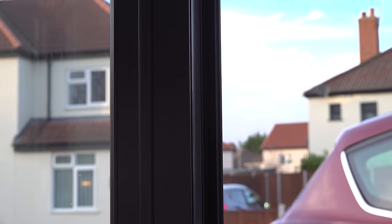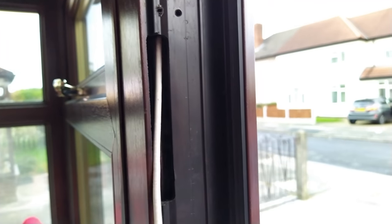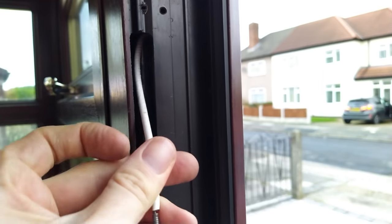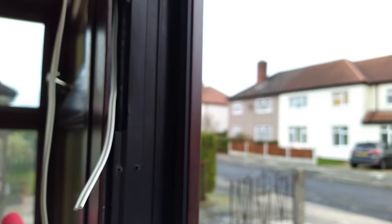Things started to get really complicated as I have a porch with a UPVC door frame and I wanted to mount the doorbell with the cables completely invisible from the outside. I started by removing the upper doorkeep to get a look inside the frame, which is obviously plastic on the outside but metal on the inside. Poking a flexible curtain rail up I could get a feel for the inside of the frame and it confirmed that the top side was sealed. I couldn't drill into the top without taking the roof off my porch, so I opted to drill a small hole near the top and was pleasantly surprised to find there was no metal on the internal side — so after drilling that hole I could poke the cable right through it. That half of the cabling operation was easy.